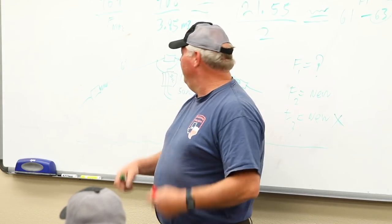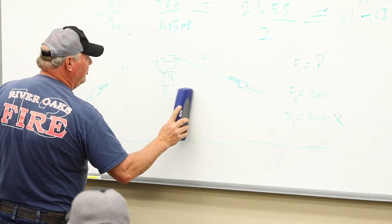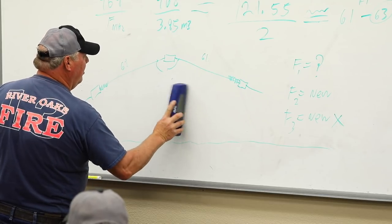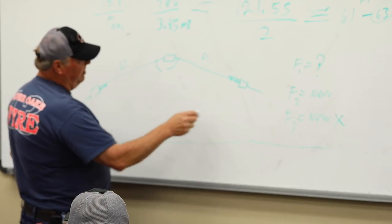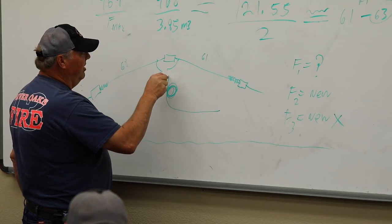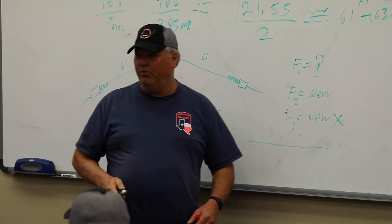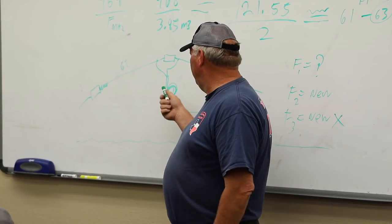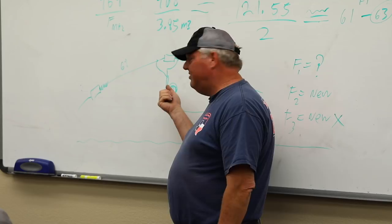What we did, we built this antenna without this balun to prove a point. Because you don't have to do that. What you can do when you're on a budget and you just don't want to do it, you just take your coax and you bring your coax up and you make yourself a choke. You put 5, 6, 7 turns and you come up here and now you've got yourself a really super simple current balun, nobody measured it, you just did it because it was what you had, and it just sticks it in there. And that will do a little bit. This is actually in some of the book.